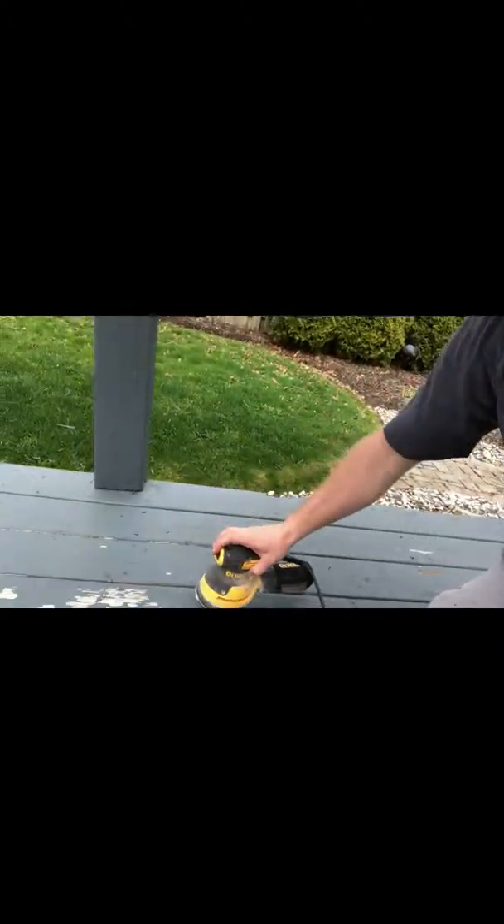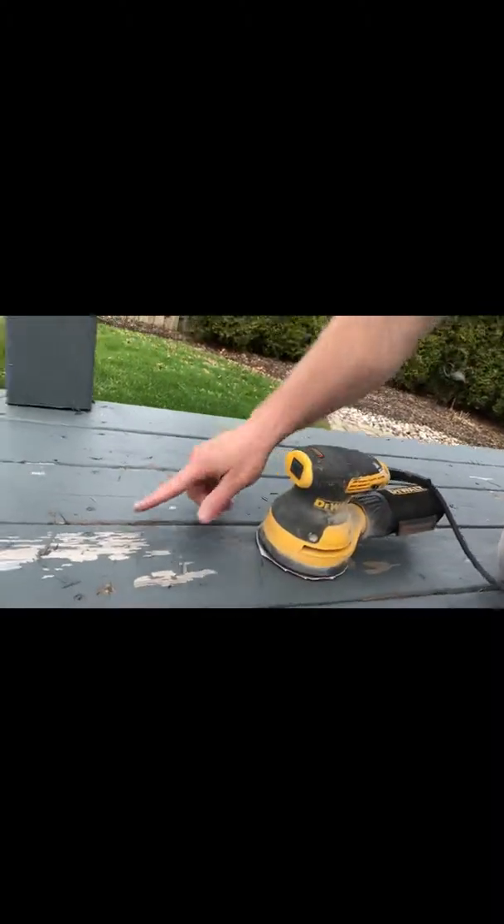We removed a lot of the paint, but now we want to go around with the orbital sander and make sure all the edges are sanded in — not getting loose paint or paint chips. We are going to be going over it with a thick substance, so it could be overkill, but the more we can open the pores of the wood the better for the Perma Bond that can seal it in there for a longer lasting finish.